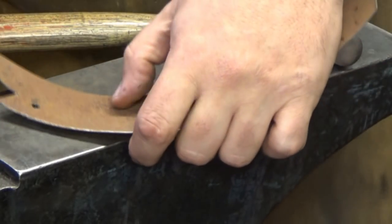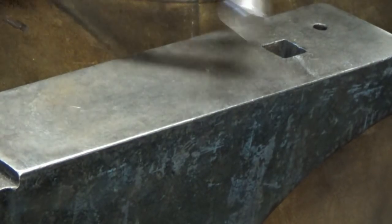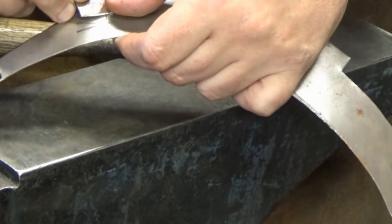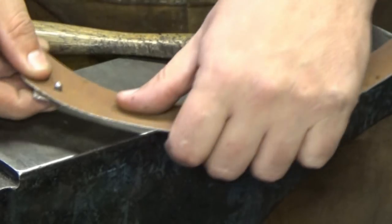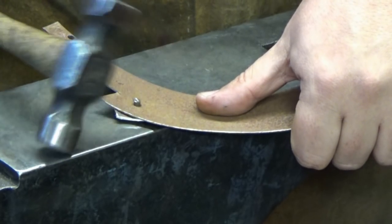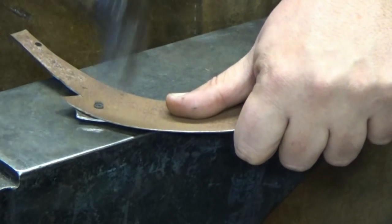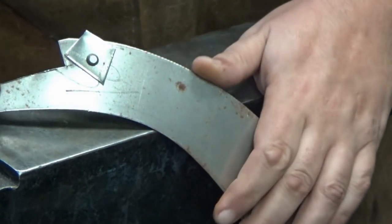As we go I'm going to try and introduce different pieces of equipment that will make this easier for you. To begin with we have our anvil — any hard piece of metal would do; even the upside of a hammer held in a vice would work. All you do is offer your two bits of material together, put your rivet through, put it on the hard surface. Here I have a flat hammer — it's not a rounded peen at all, just a flat one, just to show it can be done. Just work your way around, angling the hammer as you go. And there you go — riveted together.